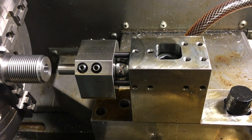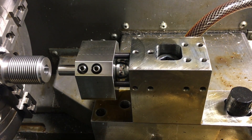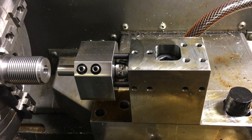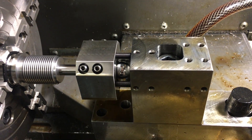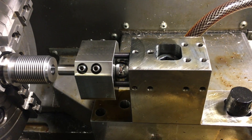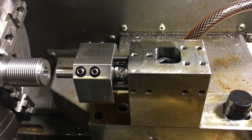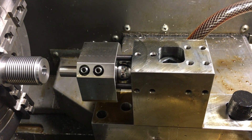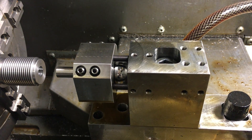What we have here is a 7/16 hole that's been reamed. We've got a 7/16 precision ground gauge pin in our holder, and I'm going to show how it fits perfectly inside of this hole with no deflection. That just shows how perfect the setup is between our barrel, our lathe, and our reaming holding setup.